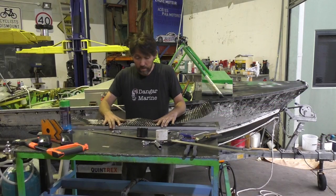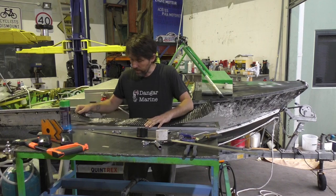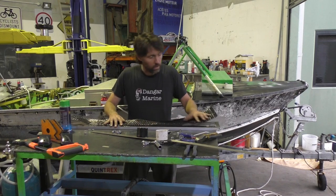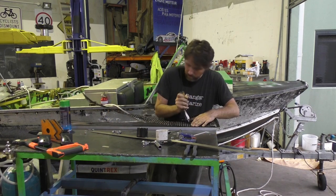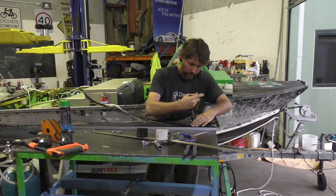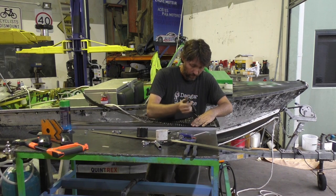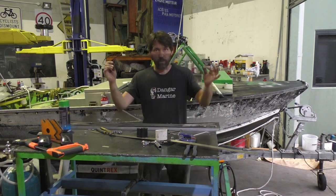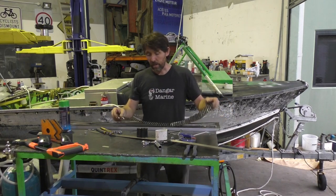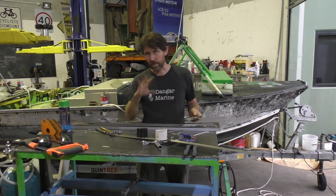The paint on this frame's touched dry now, so I'll cut this bracket, give it one more coat afterwards, and then we'll figure out a way to secure the grill to the inside of it. It's pretty soft and easy to cut this grill because it's made from powder-coated aluminium, so it should be good in a marine environment and also pretty easy to work with. So there's the first piece - I'll do another one for the other side and figure out where they overlap. I think I'll overlap them a small amount and do a strip that covers the overlap, but I'm going to run out of time to do that tonight - I've got to put the boat back in the water so I can get home.